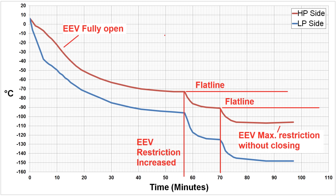Let's look at what we can do with minus 153°C. At this temperature, nitrogen will liquefy at 25.3 bar or 352 psi; air will liquefy at 20.2 bar or 278 psi; argon will liquefy at 12 bar or 160 psi; oxygen will liquefy at 10.3 bar or 135 psi; and methane will liquefy at just 1.9 bar or 13 psi. So while I can technically liquefy nitrogen now, there's very little overhead at minus 153°C because that's the cold end temperature without a thermal load. Realistically, I'd expect the cold end temperature to rise 20 to 25 degrees or more under load, so the realistic operating point for liquefying gases is probably closer to minus 130 to minus 125°C.